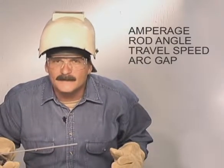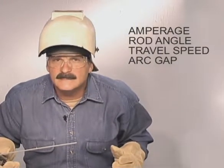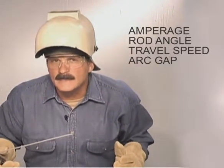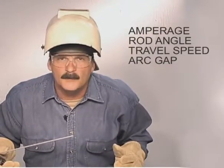You should always examine the finished weld bead for any defects, but really you need to see the weld as it's going in. This is a totally manual process. You have to control the heat and filler metal during the weld by watching and understanding the molten puddle. Look past the rod and the light, focusing directly on the molten pool. Watch the edges and the weld build up, constantly analyzing how it's flowing out and how fluid it is, making slight adjustments when necessary.